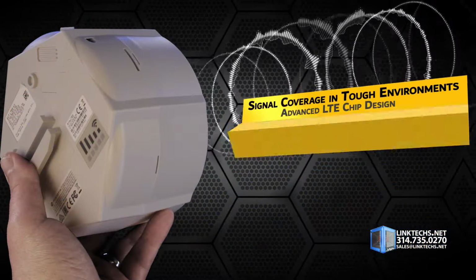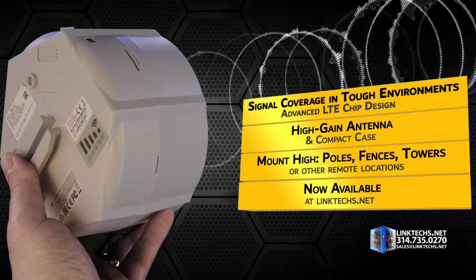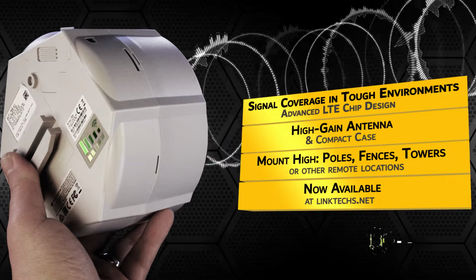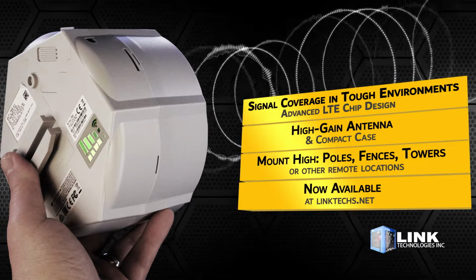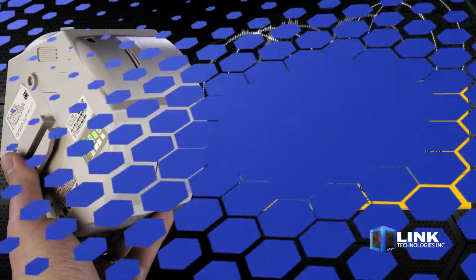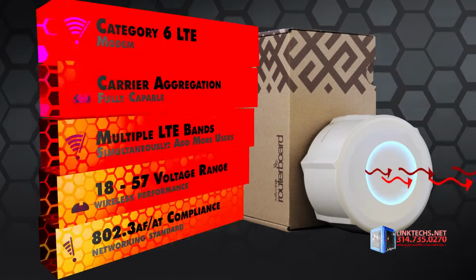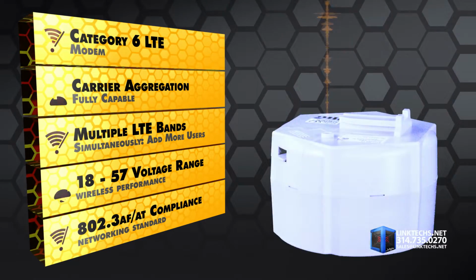This unit delivers signal coverage in tough environments thanks to its advanced LTE chip design, high gain antenna, and compact case that's easy to mount high up on poles, fences, towers, or other remote locations. This is a Category 6 LTE modem fully compatible with carrier aggregation, so you can use multiple LTE bands simultaneously as you add more users to your network.